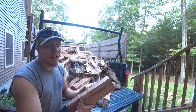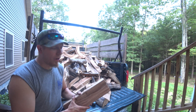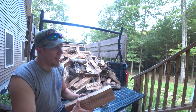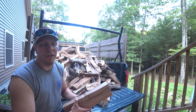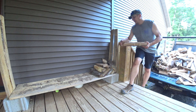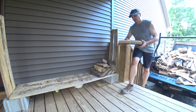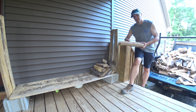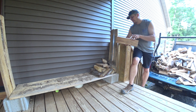So if you're interested in checking the moisture content and seeing how dry your wood actually is, the best way to do it is get one of these meters. Ideally you want to be in that 10 to 15% range — even up to 20% is acceptable in some applications. This one that I cut yesterday is going to be stacked here on our porch. I made this little wood rack — just cinder blocks and some scrap boards I had laying around — made it to fit between here and the door, and it works really well. It'll dry pretty well here because it's completely under roof and doesn't get wet at all. So it should dry out pretty well by the time we're ready to burn it.